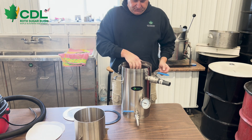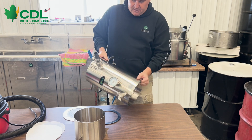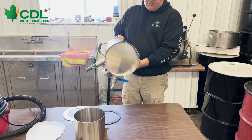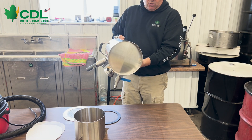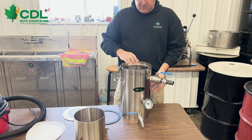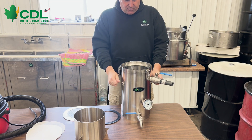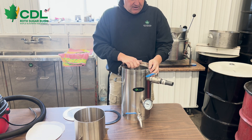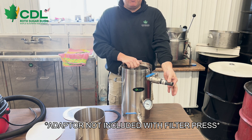On the bottom side of the vacuum filler, our floor is recessed and tapered so it's a total drain. You can also use this on a stove to maintain temperature for bottling. This is our vacuum inlet valve, so we're going to close our vacuum inlet valve. We already have our hose adapter installed for supplying vacuum with our shop vac.